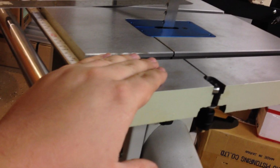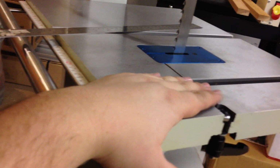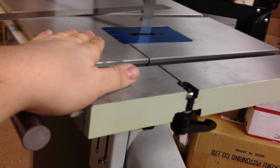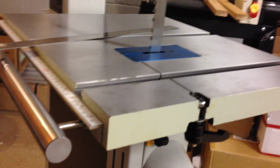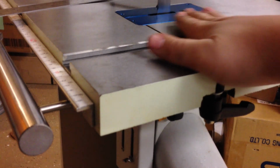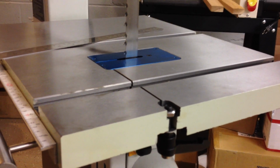Bandsaw tables are cast, and so as they cool, they've got a lot of differential stresses in them. So they probably get it right out of the casting and then machine the top of it and the sides, and then send it for grinding. And then probably the last thing that they do is cut this slot in there. And when they cut that out, it really frees a lot of the material to do what its natural stress tendencies are, and it kind of warps a little bit.